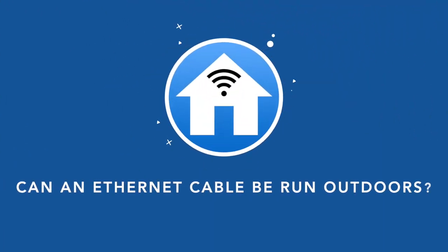The range of a single ethernet cable is still 100 meters regardless of whether it's being run indoors or outdoors. It is certainly possible to run ethernet cable outside to connect another building or an outhouse to your network, but I would recommend using weatherproof ethernet cable for outdoor runs. Ordinary ethernet cable designed for indoor use is simply not designed to handle the temperature and humidity outdoors, and the thin jacket means the wires inside can deteriorate quickly when exposed. If you absolutely must use cable you already have, my recommendation would be to house it in a weatherproof conduit like a PVC pipe, which can be buried underground. Just make sure to keep it away from any electrical cabling or anything that can cause electrical interference.